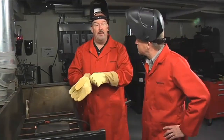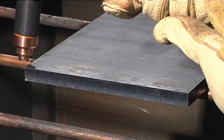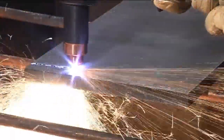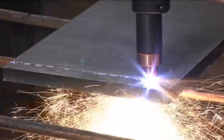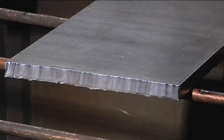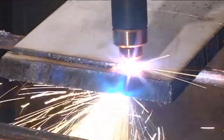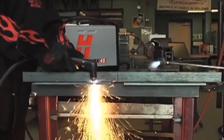Now we're going to show some basic cutting and gouging techniques. I'll start by making some simple cuts with the Duramax torch. To make a freehand cut, I'll place the torch on the edge of the metal, holding the front of the torch level with the metal and just slightly off the edge, then press the trigger to start the arc and begin moving the torch steadily across the metal. With Hypertherm's drag shield technology, the operator can drag the torch directly on the plate, even at 100 amps, with no damage to the consumables, achieving better cut quality and longer consumable life. Because of the high speed of plasma and the focused arc, the plate isn't nearly as hot as with oxyfuel, allowing operators to use the metal much sooner.